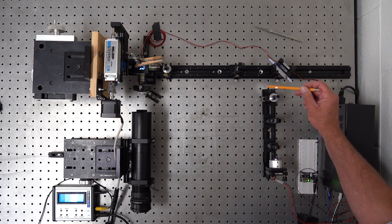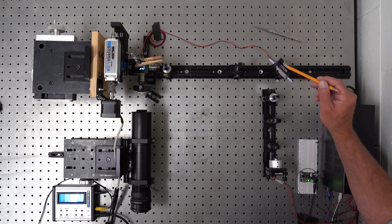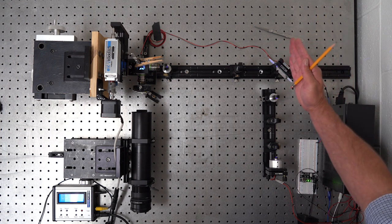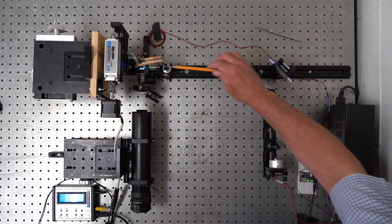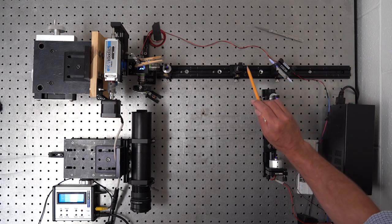This is the first lens that is cylindrical, and it focuses down to a line of light over here. If I bring this pencil along here, you can see it is a cylindrical line that comes right to focus exactly at this mirror. The important part is that as we adjust this mirror with the thread in the back, it tilts back and forth — that's one of the ways we align the slit on the sample container.